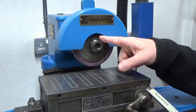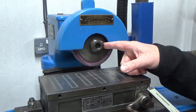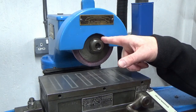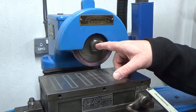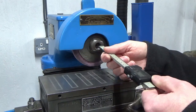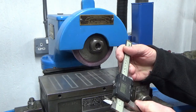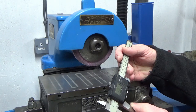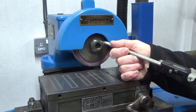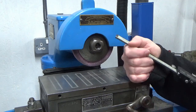I think there's more than enough scope on this front flange for me to bore a counterbore the size of this diameter to sink this nut further into the clamshell, which means I then get another 4.5 mil, potentially 5 mil of thread in the front here, which then means I've then got a good half an inch of thread, 12.5-13 millimeters of thread engagement in that nut, which I would feel far more comfortable with than what I've currently got in there at the minute.